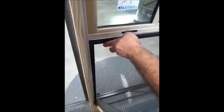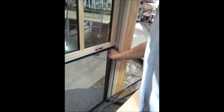First thing he's doing is unlocking. Lift approximately three inches. You're going to tilt the bottom sash out. Put this one in next to the jam liner, this one next to the jam liner. Slide down. Push in, snug up against the inside of the jam liner. Making sure the top sash is all the way to the top. Then just push the screen in.